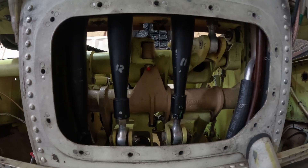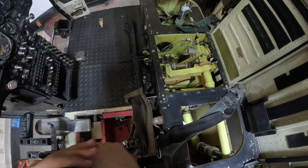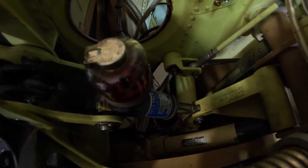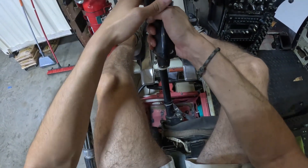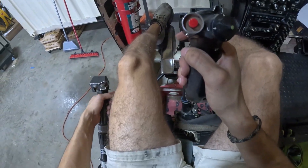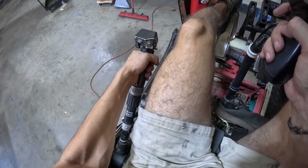After the mixer assembly, the control inputs travel through a series of push-pull tubes and bell cranks to reach the swashplate. These are mechanical linkages that transmit motion without the use of cables or hydraulics. The push-pull tubes are rigid rods that move forward and backward, and the bell cranks are small pivoting levers that change the direction of that motion. This arrangement allows the flight controls to route cleanly around the helicopter structure while still delivering precise inputs. Because the system is fully mechanical, accuracy and rigging is critical. Each linkage is built to exact length specifications and each pivot must be maintained with minimal play. If any of the bell cranks or rods develop looseness, the slop adds up across the system and the pilot will notice a delay or softness in the controls. That is why during inspections, mechanics carefully check rod ends, bearings, and attachment points for wear.